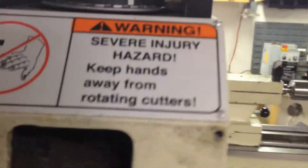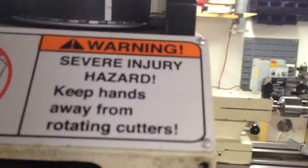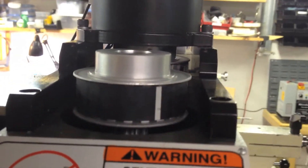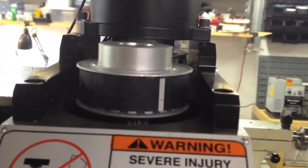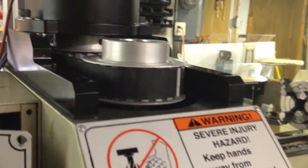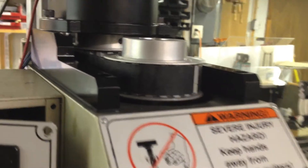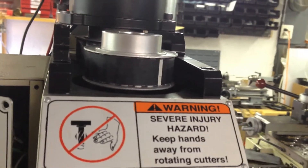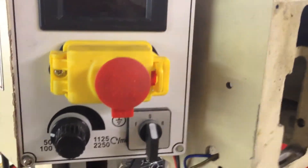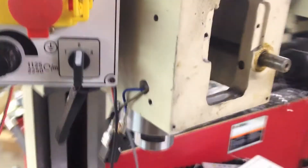Basically there is literally nothing all the way up to where the pulley is, which means I can actually mount that pulley, flip it over, mount it the other direction, and get a little bit of top from the spindle that I can use for the top hat when I put the power drawbar on — without having to machine a hole in the pulley. We'll see. I might do it that way or I might just go with the original plan. But anyway, it looks like this is all working, so now I can convert over to my KBMM board and get the new electronics set up and installed, and this machine will be ready to boogie.